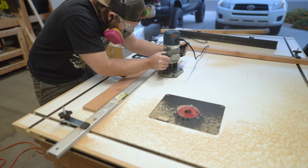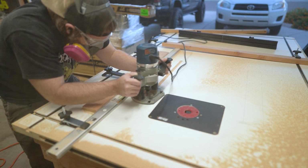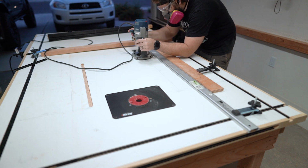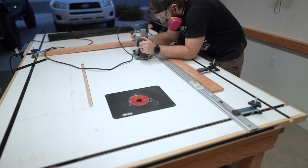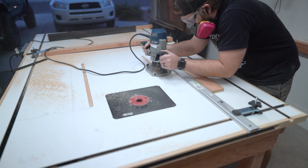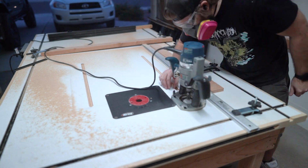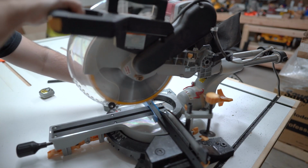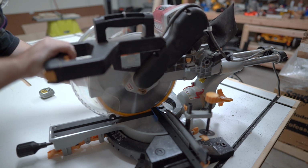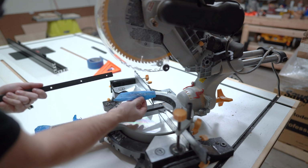I set up some guides, and take a look at the clamps that I'm using here. The T-track that's already set up on this workbench has been awesome. I use these clamps all the time. Now I know these slots are 2 feet in length, but to leave some space for the T-slot bolts, I ended up cutting at 22 inches for the T-track, and I used some painter's tape on the outside of this, which helps collect some of that aluminum dust that comes out of this baby.